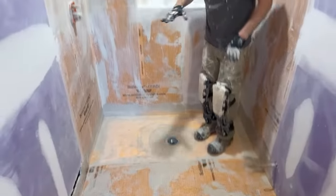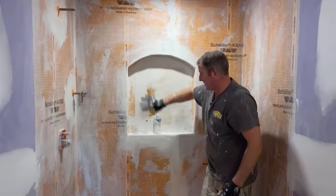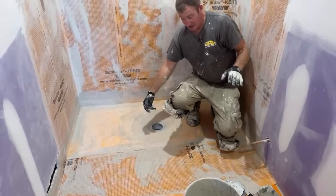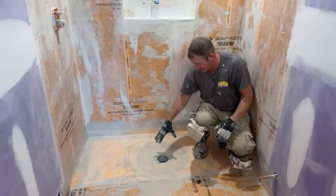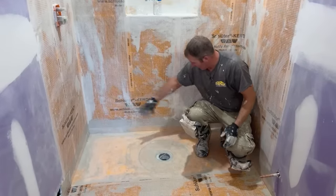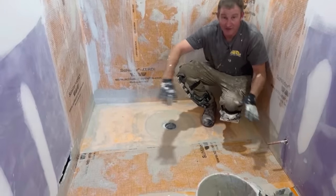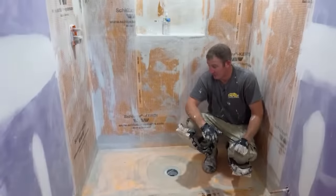All right, so just to recap, I did the Schluter membrane over drywall on the outside of this wall here. I did use some Kerdi-Board for my niche here, and then you set the pan. So you do all the walls first, and then you set your pan. And I always recommend leaving that riser pipe out of your drain and installing it after you get the pan set. It just allows you to be a little bit more accurate with setting that shower pan. And then the rest of it is just like the typical Schluter membranes around the corners. And then just putting the Ditra-Heat mat, or not heat, but just a regular Ditra mat outside. And then make sure that you span at least 1 foot over this transition between the pan and the outside floor. And that'll make a really nice waterproof shower system.